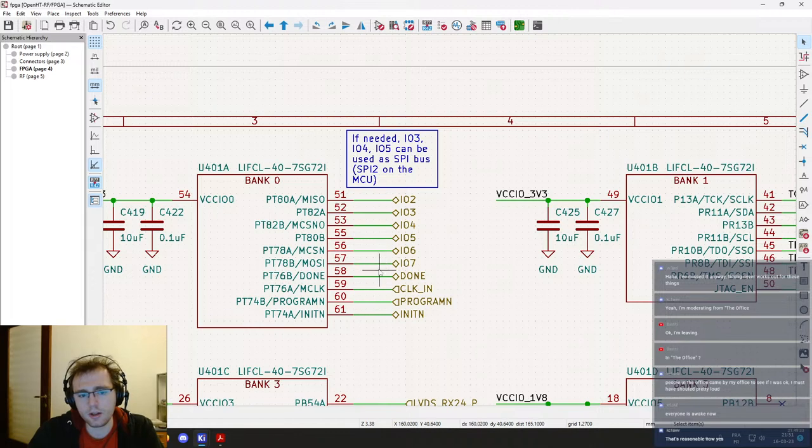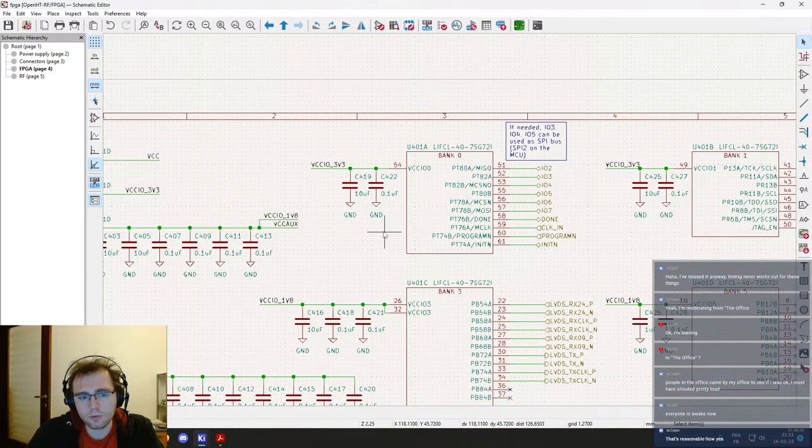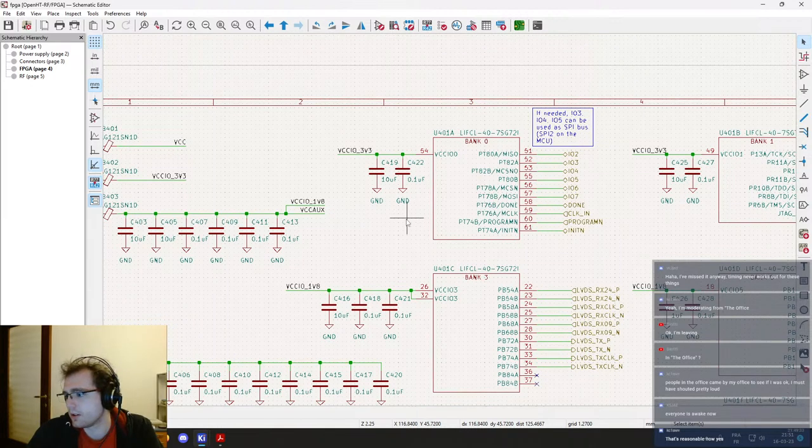I don't have the FPGA evaluation board, and I'm not really used to FPGAs, so one of the ideas would be to have a backup plan, two SPI buses, one for the configuration and one for the data. And when I speak about configuration, I speak about sending the FPGA binary for its own configuration before it starts to do what we ask of it.